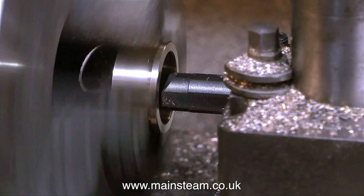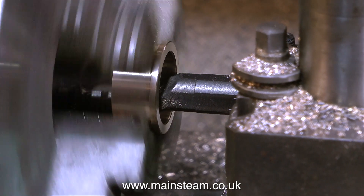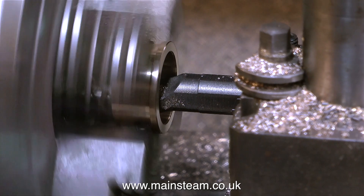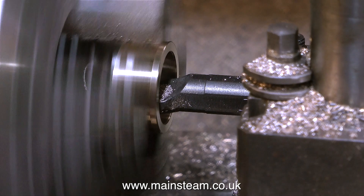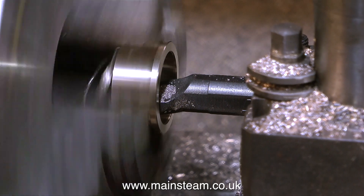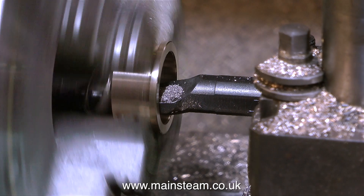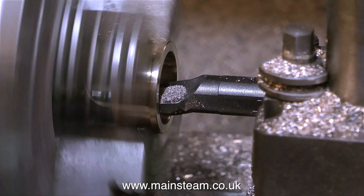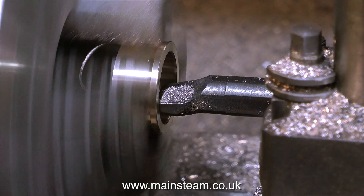So now, if you're losing the will to live, I better tell you what I'm doing. I'm making a phosphor bronze collar that fits into the flue tube to support a small ceramic burner, because I want to try this method and see whether or not this ceramic burner generates enough heat to boil the water. I find it really frustrating messing about with boilers that are powered by gas - there always seems to be some sort of a problem with them.